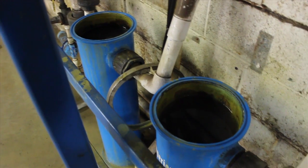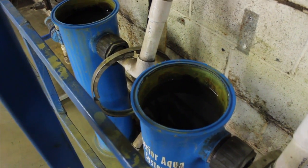Our water just happens to be very good for growing. We have very low salt, very low calcium, very low magnesium. The only element that's a bit of a problem is iron — it tends to precipitate out inside these tanks, causing what we call a green slime on them. So we take them out once a month and power wash them to keep the efficiency of the system going.